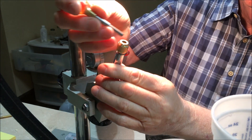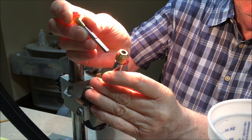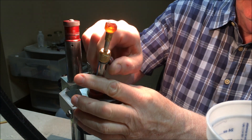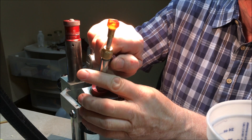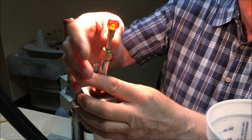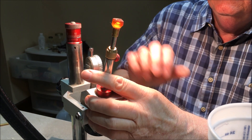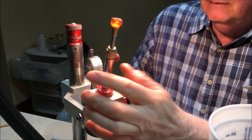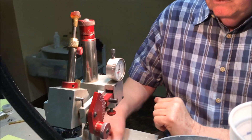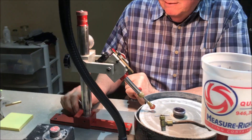This is the quill of the machine, and here's where you'll put your dop. The tops of mine are keyed — most of them are keyed some way. You slip it in and you tighten the set screw, and then you tighten the nut at the end of the quill. Make sure they're good and tight, and then your dop is in position and ready to cut.